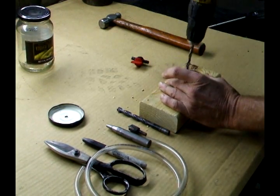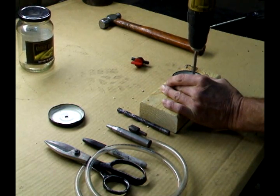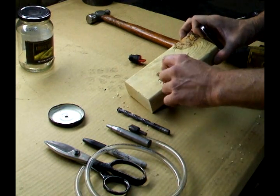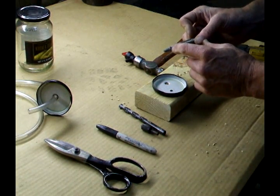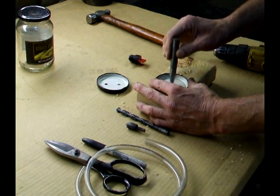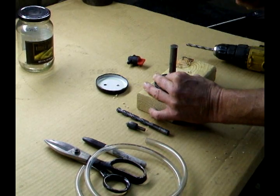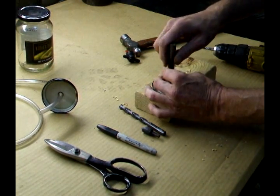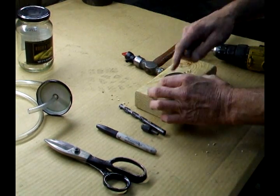In the other lid I'm going to drill two holes close to the center. What I have here is a 3/8 hole and I've chamfered the corners with one of these 45-degree chamfering tools. I made a mark on my punch that shows me about where 3/8 is. I'm going to set this in the middle and take a tapered punch and drive it — that's going to curl this thing out. Punch in there, punch that hole.